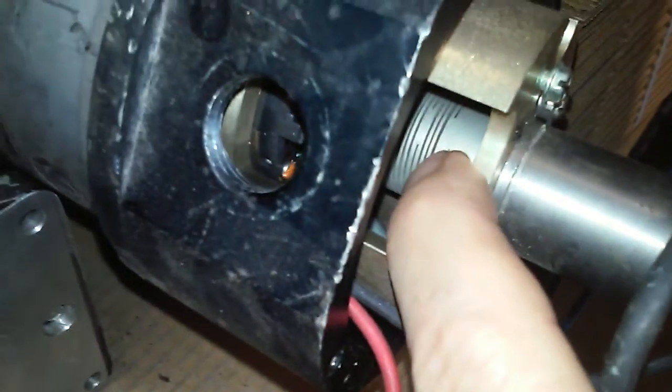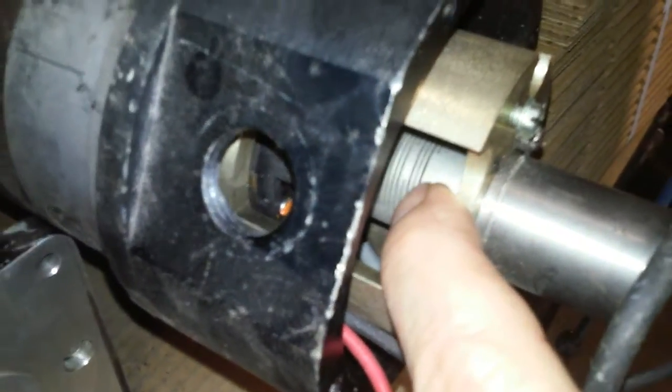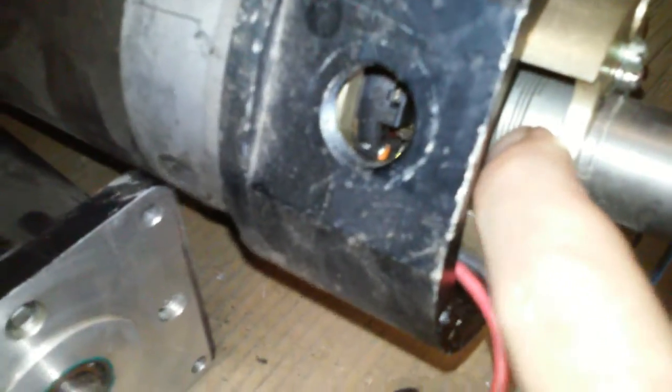Your coupling is down in here. It takes a little tiny Allen wrench. There's two types of couplings — there's this one and then there's one that uses a little spring washer. They take a little teeny Allen wrench. This takes a metric shaft in here, so if you get the wrong coupler and it has an eighth inch, then it can slip. So be aware of that.